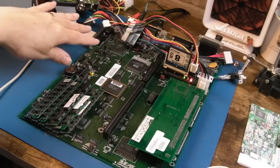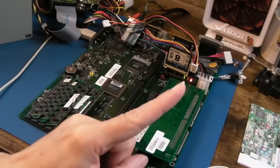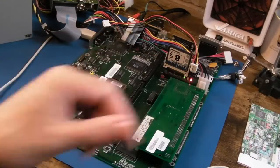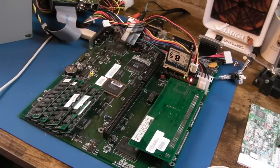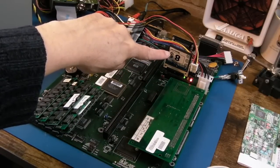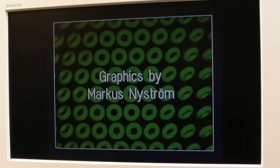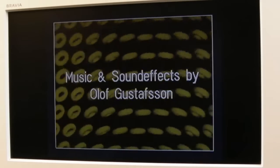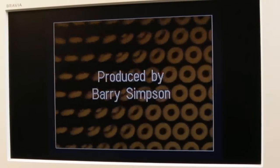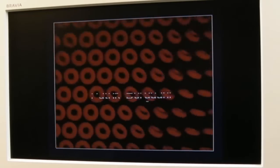Before I do the next lot of cleanup, I just swapped over to my CPU card that I fitted an 030 with an MMU in a previous video, link will be up there. I fitted my compact flash card and my Kickstart 3 ROMs, because with Kickstart 3.1.4 it was going on about IconLib, and without the MMU I couldn't boot from this compact flash card that's set up for the 060 that uses MMU Lib. I'm going to test a few games from the compact flash card to make sure it's working, in particular Dune, because when we've been playing that from floppy disk, there are some timing issues where it misses a note as it transitions frames and sections of the demo. I think that's just because the floppy version isn't designed to run on an AGA system by default.